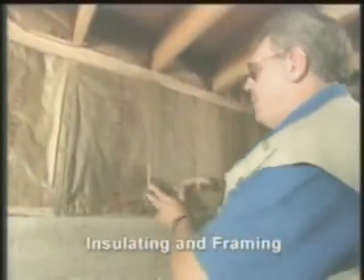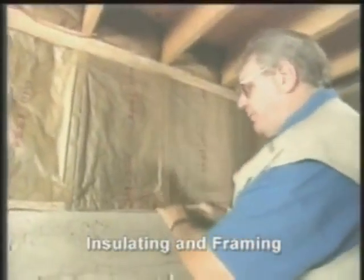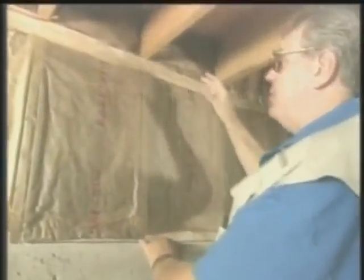How we go about this proper finishing using this pony wall on top of the concrete wall, we'll go right up to the top plate here now and show what some of the most important things happen to be. One of them being air movement between the joists out behind the insulation that you can see here. In this particular case, this home dates itself because the kraft paper with the moisture barrier in the back goes back well into the 70s.